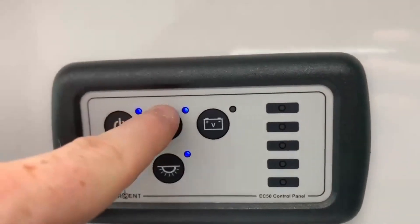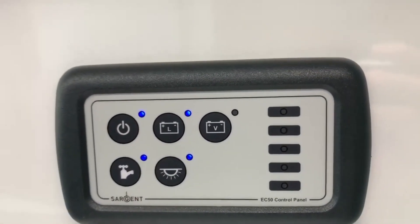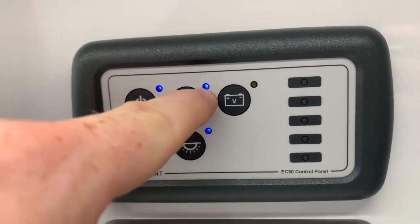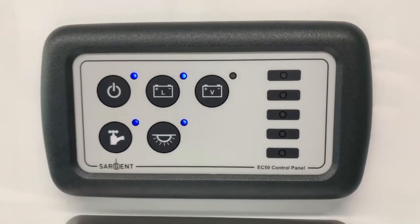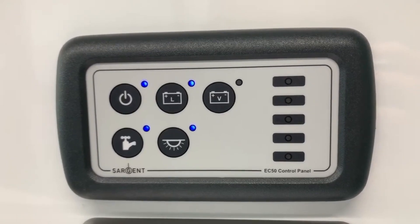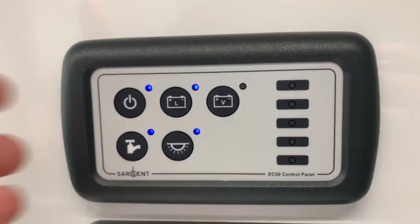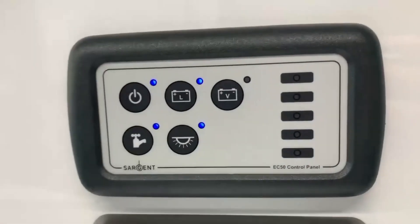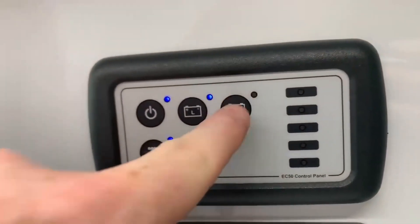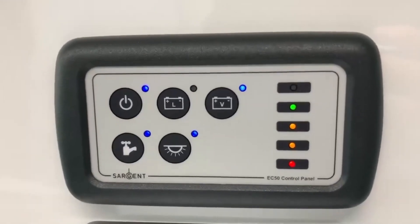With regards to the battery voltages and the display, when the battery voltage gets low — around 9 to 10 volts — this LED will turn red and it will alert you with an audible beep. Then after a minute it will actually shut the power off to the control panel to protect the energy levels in the batteries. So if you hear that beep, or if you come in one day and find your power is off, there's a good chance it has shut itself down to preserve battery power. On the vehicle battery side it works the same way but the voltage threshold is higher — at 10.9 volts. As soon as it drops below 11 volts the red light will show that power is too low and it will shut off within a minute to protect the battery.